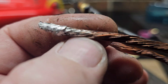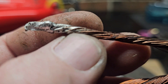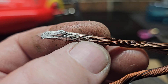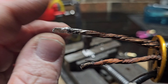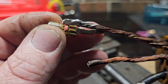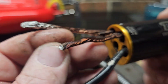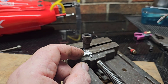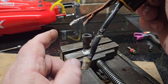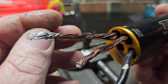You can actually see up here where we didn't really scrape the wires all that well — it didn't want to stick to one wire, and then the wire next to it stuck to it pretty good, because we didn't scrape the insulation all the way up. You really just need that much wire stripped off the end of the motor wire so you can get the solder to stick and get your connector on — boom, a good solder joint. This other one we just cut the wire, didn't clean any insulation off — we fluxed it, dipped it in the hot crucible, and the only place the solder stuck was at the very end where we cut the wire.